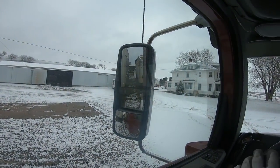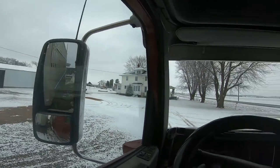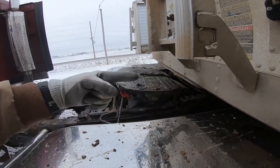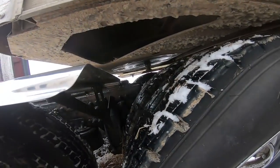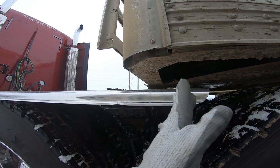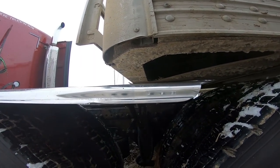We had this on our cattle hauler — Nathan got it all shined up and washed, so what better way than to get it dirty again the next morning. How I hook up the trailer after I've greased it: I lower the air suspension, then I line up the outside of my tire with the outside of the trailer. I go out and check a couple times to make sure I'm lowered enough. I only greased two-thirds of the way, so I'll back up to the kingpin, raise up, and that grease makes sure everything is covered.